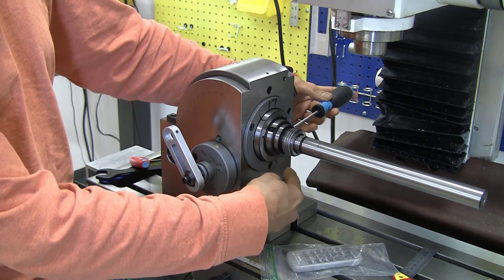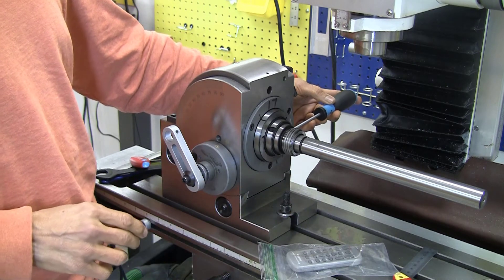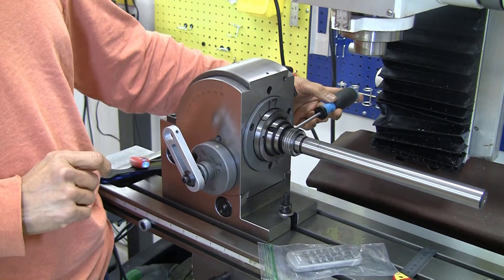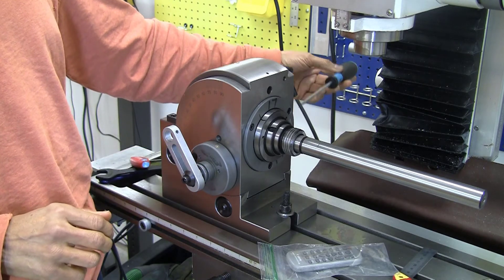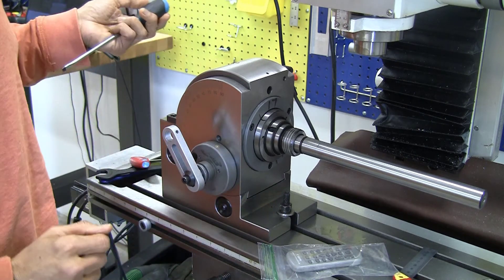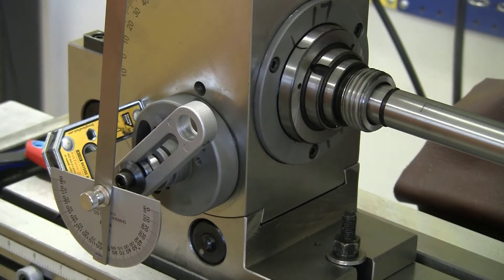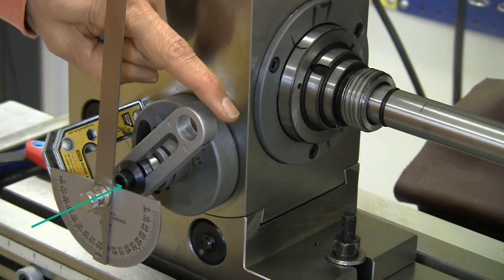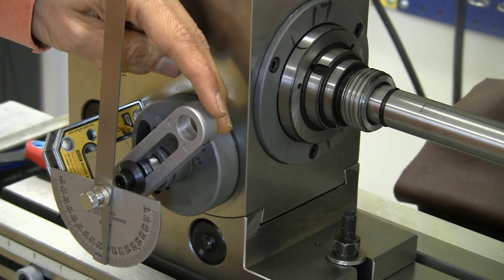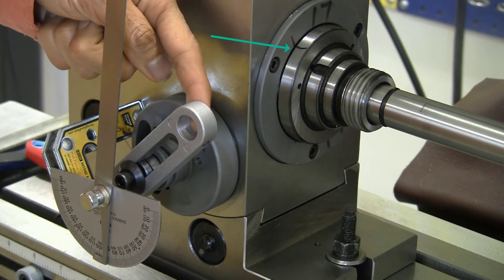Now one screwdriver is on the other side. I have loosened up the set screw in the front of the housing which holds the backlash screw from moving. Now I will gradually loosen or tighten that backlash screw until I have good movement and there's not a lot of pressure coming towards me. I have put a protractor on a welding magnet with the protractor in line with the axis of the handle for turning the worm. You can see the sharpie mark I've made.